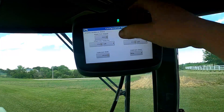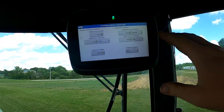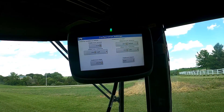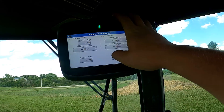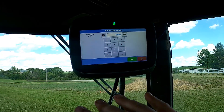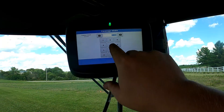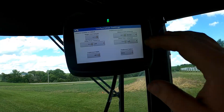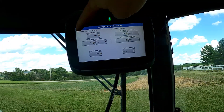Now that we're in the back of the field, we've got guidance. We'll click on the wrench. Height from the ground — 14 feet is the setting, but we're not quite that high, maybe about 11 feet. Distance from antenna, implement location. The antenna is the globe — without measuring, 20 feet is pretty darn good. We're not offset from the center line. Here's our implement width — how wide of a swath you're going to be making. This supposedly spreads at 50 feet, but I'm going to say 48 to give a little buffer. There's no implement switch to mark when it turns on or off. That's all we have to do to set up for steering.